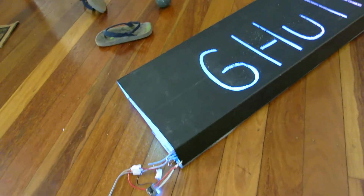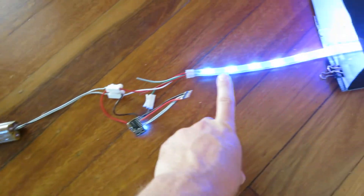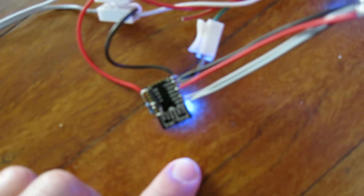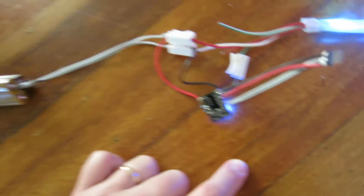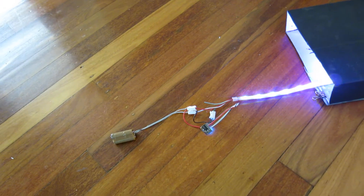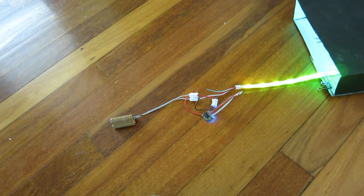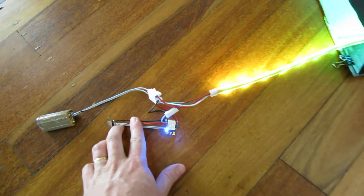That's powered by this system — there's a meter of LED tape, and the ESP8266, chosen simply because it's a very cheap microcontroller, and three double-A batteries. That should run it for about four hours; it pulls about 300 milliamps.